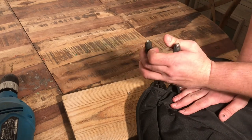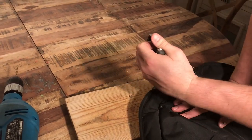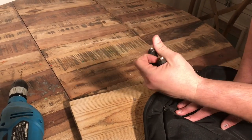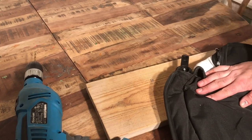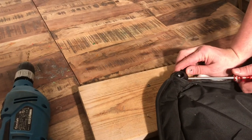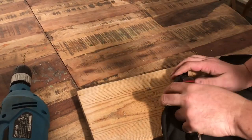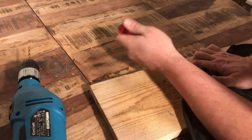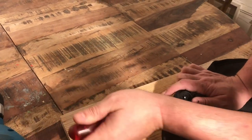I'm going to pinch off the head a bit so I can get the outside plastic piece removed first, and then I'm actually going to sand down the head of what's left of this rivet, as it makes it a bit easier to pull through the rest. Use a flathead screwdriver or something like that, get it in under that outer piece, and just force it off as carefully as you can.